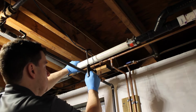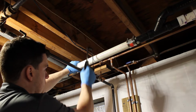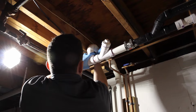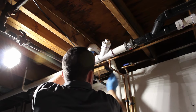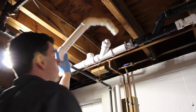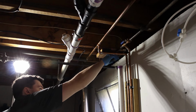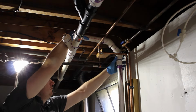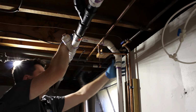And it was right at this moment as I cut this pipe open that I discovered that the previous owner had just dumped mountains of fat down this line, and it was completely caked. I had to snake it out. And you'll notice here I actually also put in a Y fitting so that I could put a proper cleanout, so that in the future I can snake this thing and clean it out if I need to. There wasn't one previously. Now that I've got these joints glued, I'm going to put this in place and hold it until it sets.